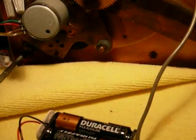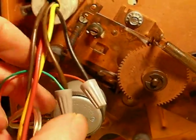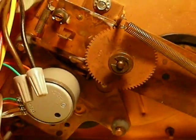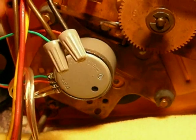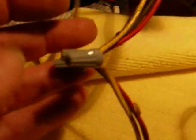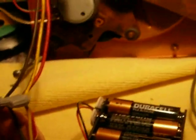Taking a look underneath the changer here — the hookup from the switch and so forth. To hook up the motor, the green wire will go to the brown wire from the switch, and the black wire from the switch goes to the red wire of the motor. That's the only thing contrary to normal wiring, and it's because that's the way they're wired at the factory — I've never seen one wired differently. These wires are the standard wires to go back down to the amplifier. I clip them to make it more convenient to work on.